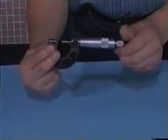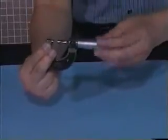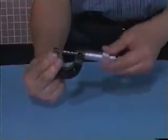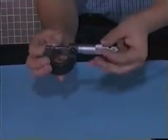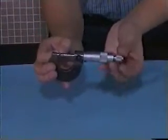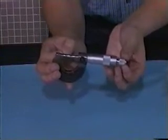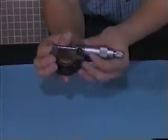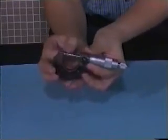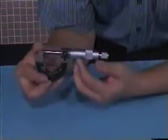Reduce the width of this opening, wind up the large button, okay, and then place the metal wire in between the gap and wind up the button until it is tight. We then wind up the small button until the sound tack tack is heard. Lock the position and we can take the reading now.